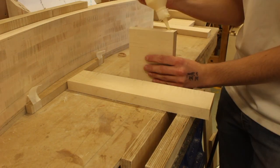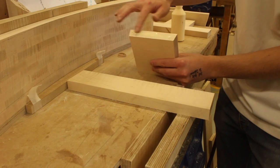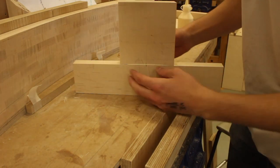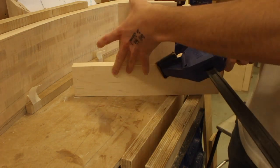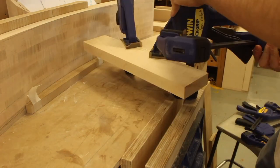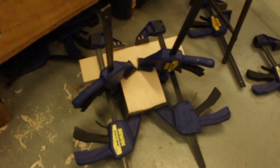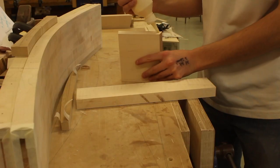To help have no gaps, the area that the rail will be glued onto the curved rail I sanded flat, so there would be no gaps when I glue the side rails onto the curved rails. What I'm doing now is gluing the two pieces together. I put parcel tape around my clamps so they wouldn't stick — this is a quick way instead of having to plane a piece of wood and put parcel tape on that. You can just use the clamp itself; as long as you put parcel tape on, it won't stick to the wood.